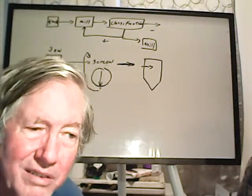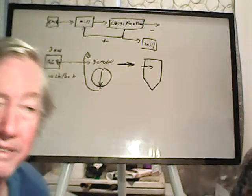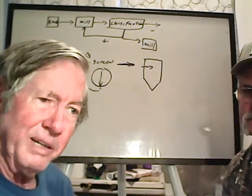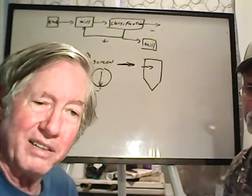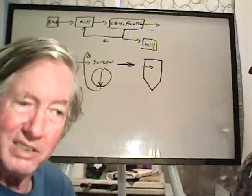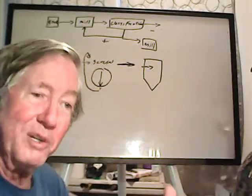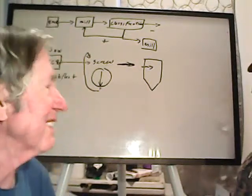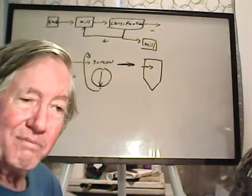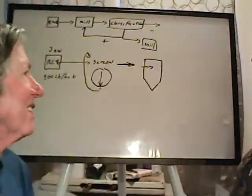Yeah, we're melting gold. We're processing the resin, smelting the gold, doing cupelling, stuff like that. Anytime you get a spill, it tends to literally just eat through the bottom of the kiln. I had a cupel with some lead in it. I was just trying to move it, and I bumped it, and it just splashed on the bottom again and put holes right in the bottom. Now, they do make this interesting stuff in tubes that you can use to repair damage like that. It's pretty hilarious. It seemed to work pretty well. But I'd like to have just a replaceable thing, and especially if you had a little spill on it, you could just take it and put it on the belt sander and put it back.